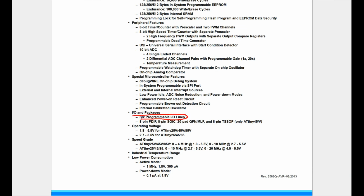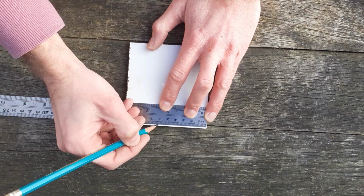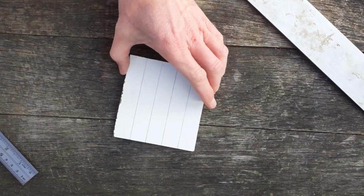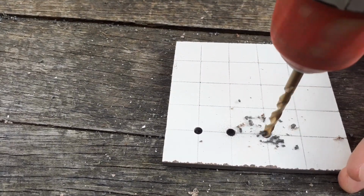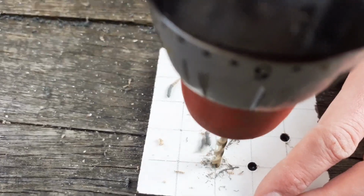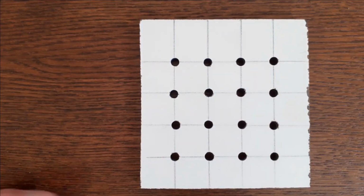Now with the theory out of the way, it's time for some practice. To make the LED cube, I start with making a small jig for holding the LEDs in place while I solder them to make the layers. The jig consists of a simple grid of 5mm holes, of which I determined the pitch such that I would just be able to solder the leads and not need any additional wire. This pitch turned out to be 1.5 cm.